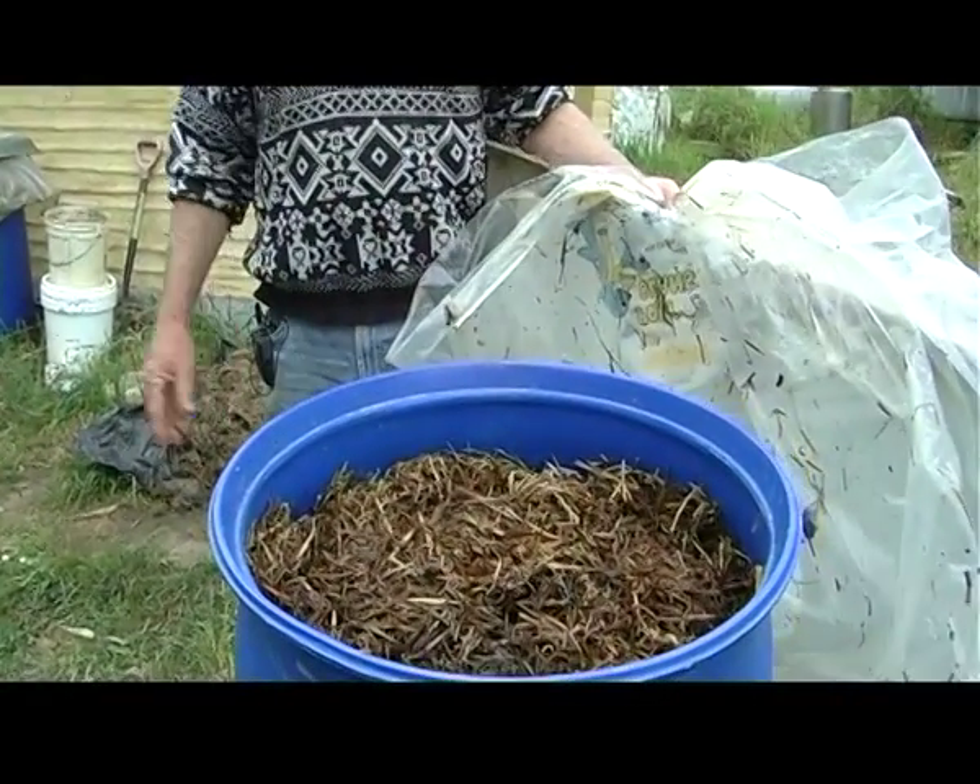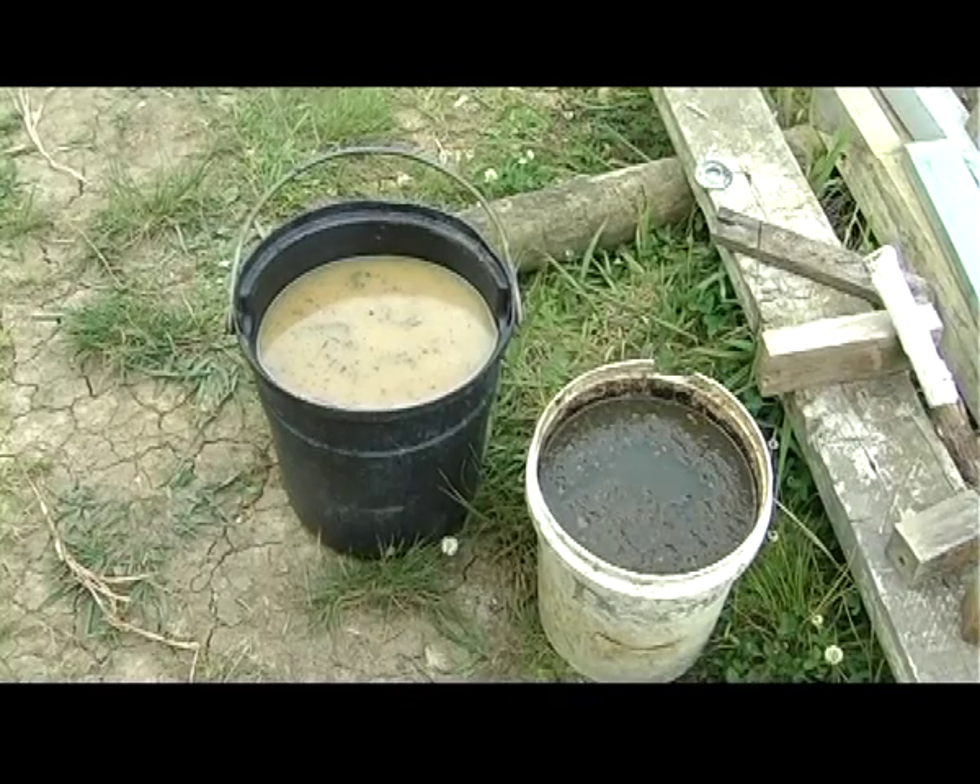I'm thinking I'll have to construct a heat hut — just a solar trap with a wood burner booster. I've got grass, apples, and household scraps. If I'm careful and get an efficient system, theoretically I'm just outside the envelope at the moment, but if I'm careful I might be able to run it totally from this place. The effluent that comes out of the digester has to go back to the lawn and the garden, otherwise I'm mining it. So I should have a closed system right through.